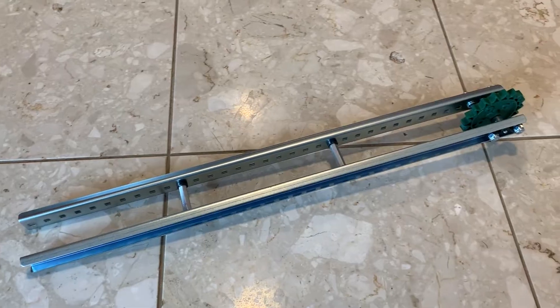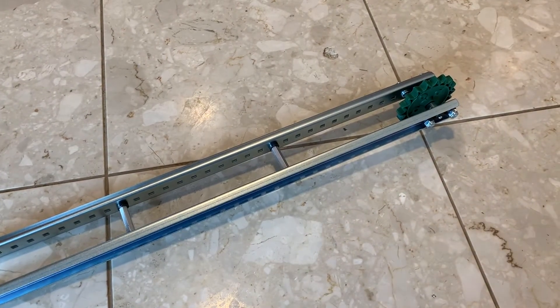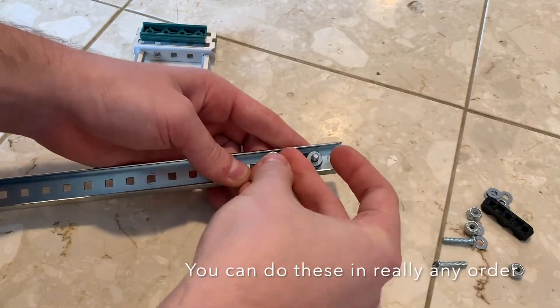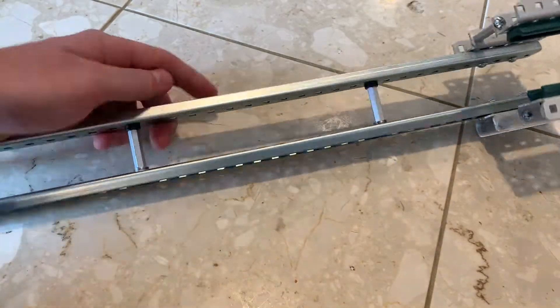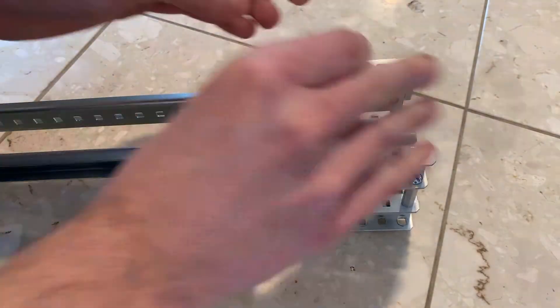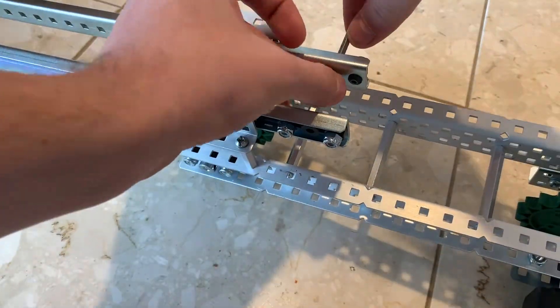Now that we have the base done, we need to build the first stage. To do this, we first take two linear rails and attach them with standoffs. We then need to attach two bearings with three washers apiece. On the outside go pieces of C-channel. Standoffed to these are two more pieces of C-channel which have the slides on them. The reason we use the bearings is so that we can use the sprocket here. After assembling this, we need to slide it onto the base, after which we install two more bearing flats and then another sprocket on the other side.